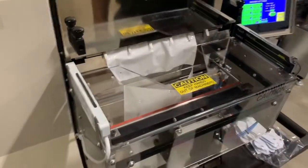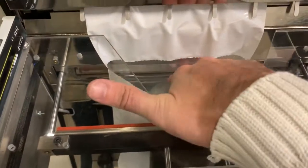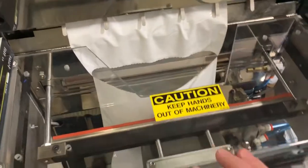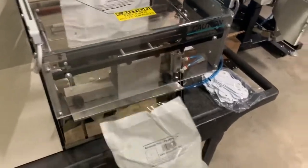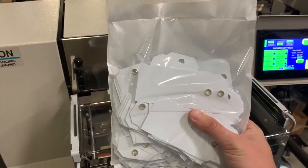Jim is just going to load these in by hand to show you what this is going to look like. He just dumps a hundred of them in there. They all usually fall to the bottom of the bag in testing. Once in a while you might have a piece come up into the sealing area, and at that point the operator just needs to push it down, make sure it's not in the sealing area, and then once the products are in the bag they just hit manual cycle or hit a foot pedal. It'll seal it up and then drop. This is what a final 8x10 bag looks like with a hundred parts inside of it.